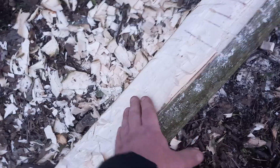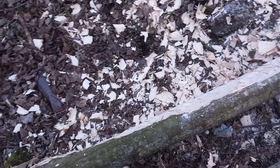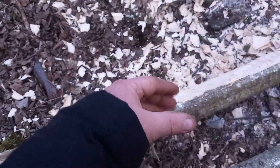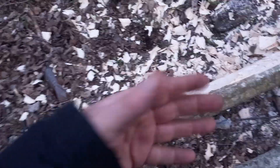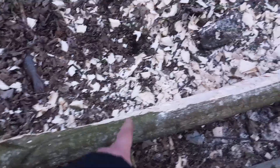Feeling this — it's really, really wet. That's an example of how much moisture has to come out of this log. When I get it home and start making a bed out of it, it doesn't matter that it's full of water — it can just dry over time. So long as I don't set the joints it makes with other pieces, I can trim those later. When the wood is finally completely contracted and dry, that's the moment I make my proper wood joints with the other pieces.